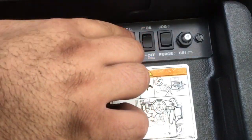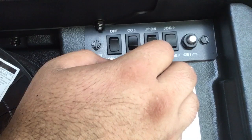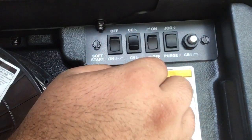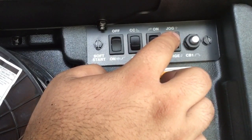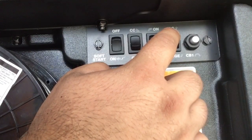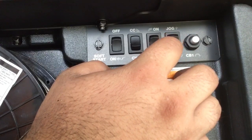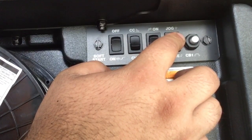Mine lives in constant current mode hooked up to the Champion Elite. For 2T and 4T settings, you definitely want 2T mode — you hold the trigger to weld. We don't want 4T where you click and it keeps going on its own. The jog button is one of the best features in the machine: hold it down and it runs wire out at full speed to the end of the gun without actuating the gas solenoid. The purge button opens the gas solenoid without pushing wire, letting you purge all the air out of the system — not a necessary feature, but a great one to have.